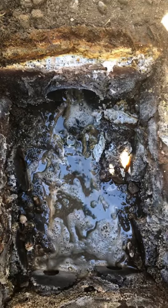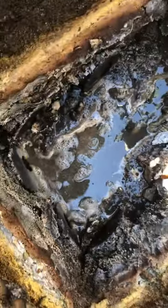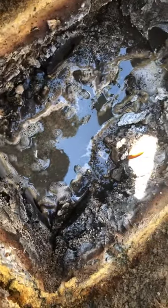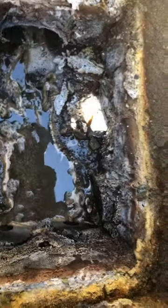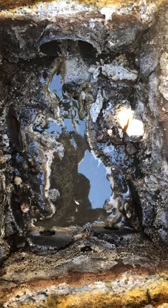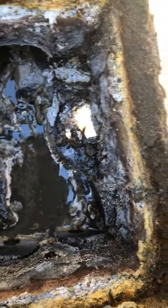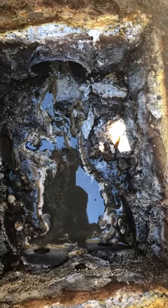We just ran a little bit of water, and you can see exactly where everything's going right now — all the water is going right into those two lateral sections of the drain field. This was just to test out the short circuit, and sure enough, just to confirm those two are accepting the most amount of effluent. That's why we have issues down below.